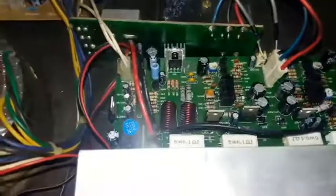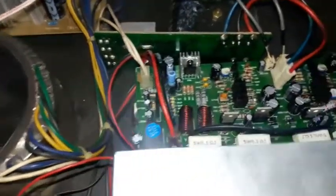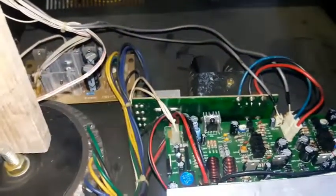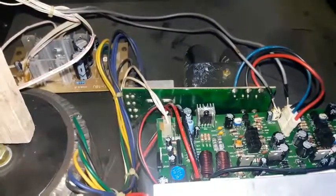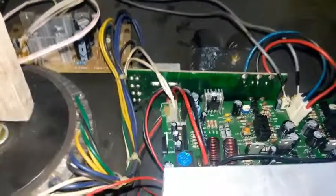As the amplifier board has been put in the mixer cabinet, I installed the last component, which is this diode over here, and I installed a 12-volt regulator for the fan, so we can supply this 12-volt fan the correct voltage to it. And there is an assembly problem that came from the factory I would like to refer to.